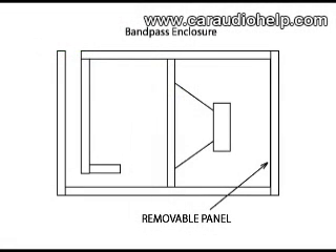The material will not be visible when the enclosure is completed. You'll need to either mount the woofer prior to completion or make one of the panels removable. I always make the panel removable in case the woofer needs to be repaired or replaced. I accomplish this by leaving one end caulked and screwed but not glued. We'll cut out the hole for the woofer and the terminal cup at this time.